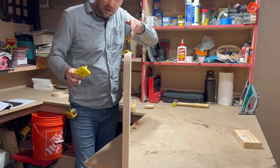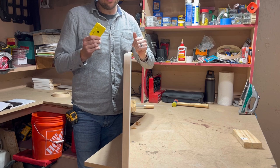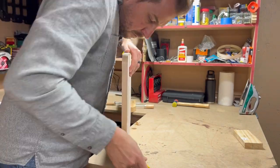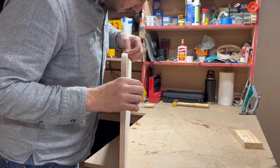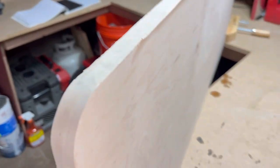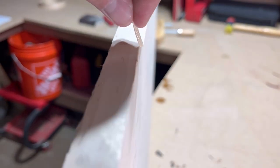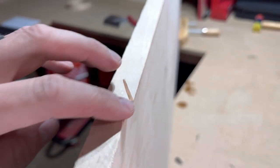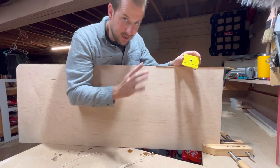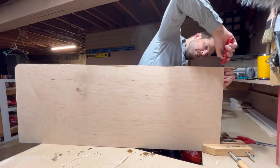I'm going to take my trim-off tool and run it right down the side for the edge banding — but be careful, because sometimes it does gouge into the wood. Usually I use the router, but it's cold and dark out so I'm giving this a shot. And here's exactly what I'm talking about: it'll bite on the grain and run into the edge a bit. We can still sand that out, but I'm not the biggest fan of that thing.